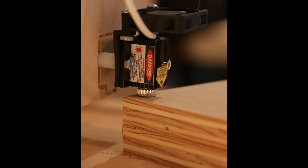The final picture shows how I use a focus spacer. I have a scrap piece of glued-together three-quarter-inch plywood, giving me roughly an inch and a half as a spacer between the laser lens and the material I'm going to burn. Once I focus at that inch-and-a-half distance, all I have to do is slip that double piece of plywood between the material and the lens, then very slowly screw down the lead screw until the lens is just barely off the top of the plywood. That keeps the beam focused at an inch and a half continuously. That wraps up this video — the next one will have some actual burning going on.